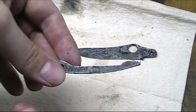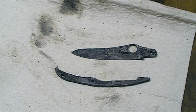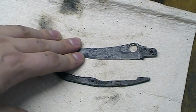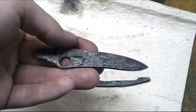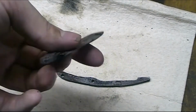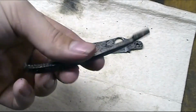And then here's your back spring, which I hardened. So some tempering. This guy's going to get tempered, I want to say 400 degrees Fahrenheit, for about two times for 2 hours. Double check, I have all this stuff written down. Yeah, I'm going to temper at 450 degrees Fahrenheit for 2 hours, and then do that twice. And that'll leave it in the upper 50s, probably like a 58 Rockwell hardness. And then this guy, I'm going to temper along with him, take it down to like the 58 hardness.